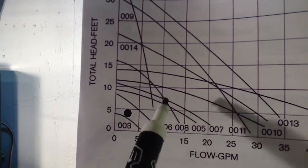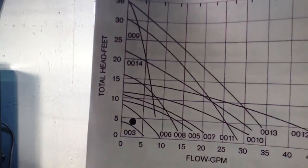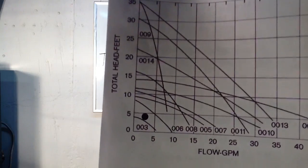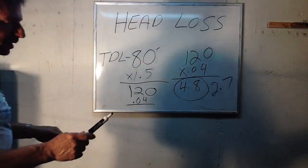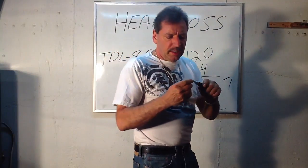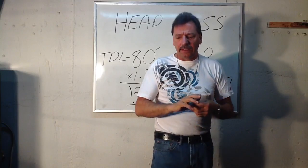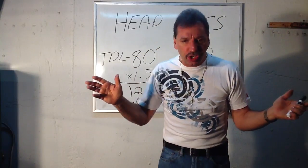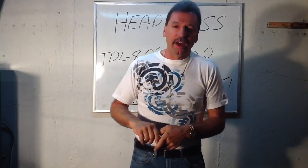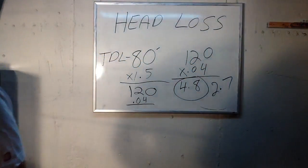Just to give you an idea: wherever you land with that dot, it has to be a pump curve close to that. That'll help you big time on selecting the proper pump for your zone of heat. You can download that pump curve chart on taco.com. I hope this helps you guys a lot in selecting the right pump, because that's the math for it.